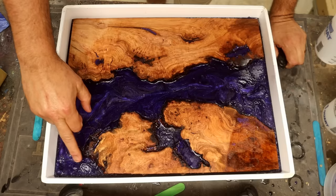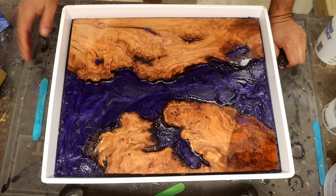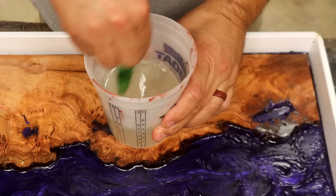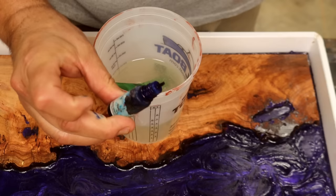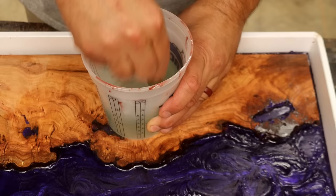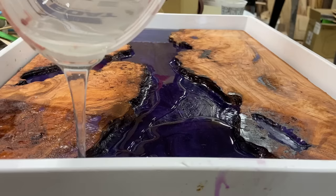So this is it all cleaned up. You can see that putting it in while still wet made things a bit gnarly. I don't know if it's going to work — if not, we'll just plane it down until it's flat with the purple, and that'll be fine. I put a clear coat over it, but I want to make this a really thick one, so we'll see. We're going to use the 2-to-1 resin with my pump — I've got it cleared out and working fine. The 2-to-1 has a slight yellow to it, so I'm going to add a drop of blue sapphire to counteract that, which helps it get a little clearer. I also checked to make sure the pump wasn't clogged again.